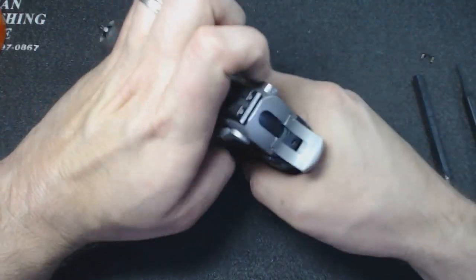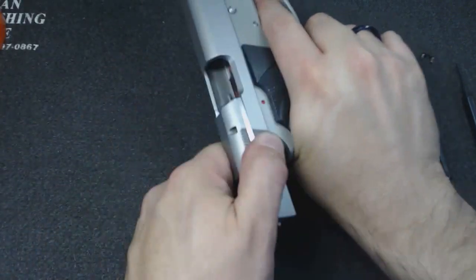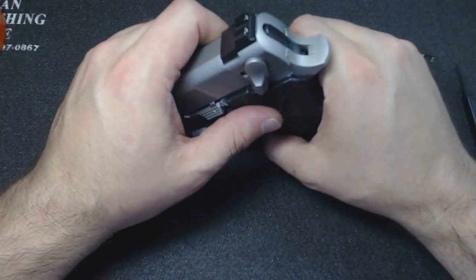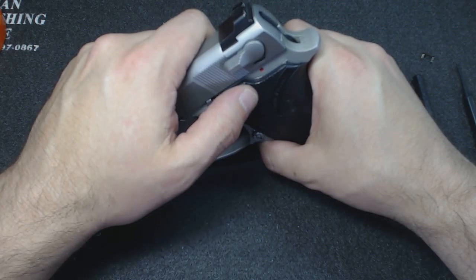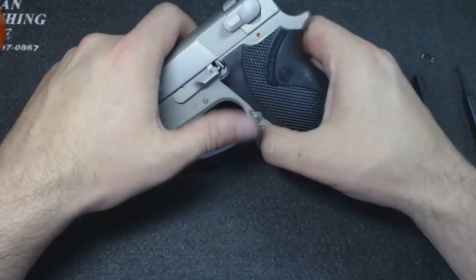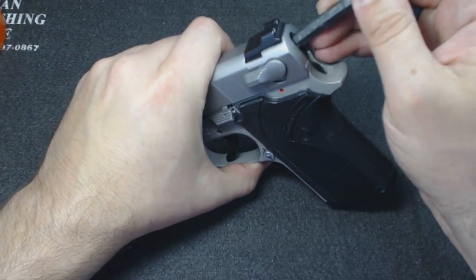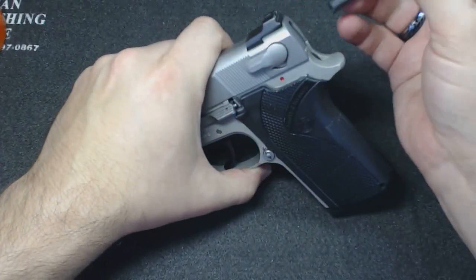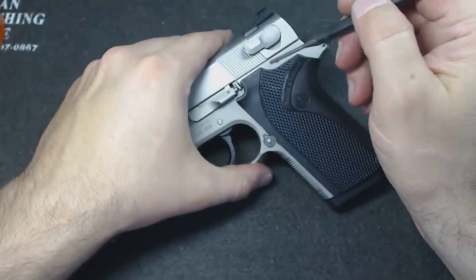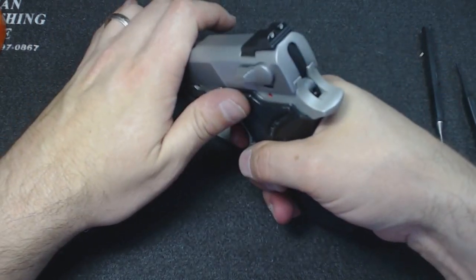Trying to think if I can convince myself whether that is in any way unsafe or not. So if it was cocked and we had a round in the chamber, we put the hammer drop and the safety on, and now we go back to double action mode. Oh, the firing pin safety is not operated until we actually pull it back. So I was wondering if something could hit this hard enough to set it off, if you dropped it and something came in at the right angle to hit it. And the answer is, well, yeah, it is making contact with the firing pin, but the firing pin safety is preventing the firing pin from going any further forward than that. So it really is safe.